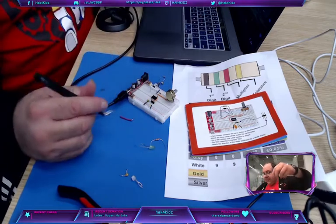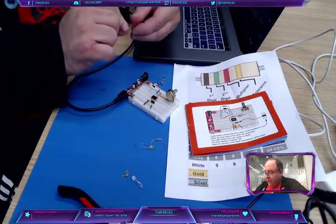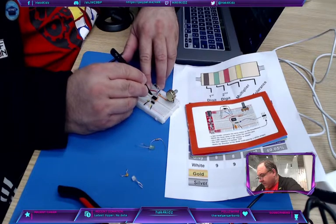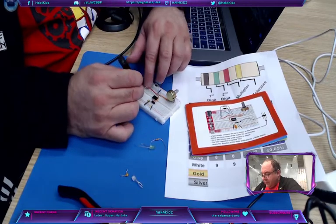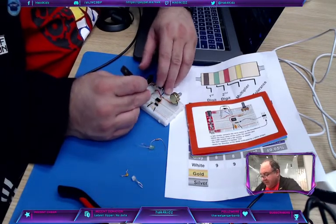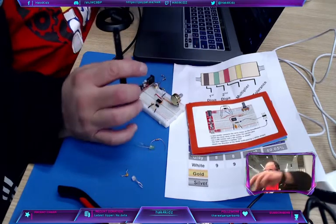That's weird. All right. I think I got one more wire, which is this red wire right here. So this red wire will go next to this guy, the diode, right here, which is pin 7 on the timer. And then we want this all to come together. They got a nice little wavy line there, but in reality I can't do that, so I'm going to bend it. I use the back of my tweezers to bend it. And let's get it in there. So you get a nice happy family. Boom. Check your connections. Make sure you didn't knock anything out.